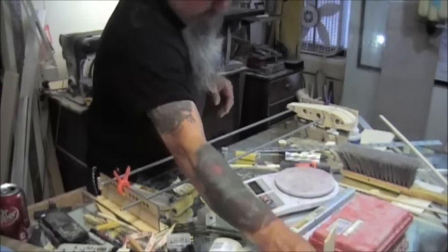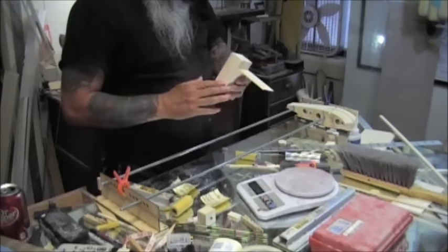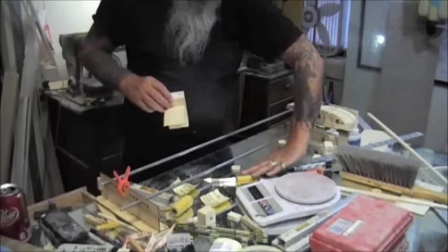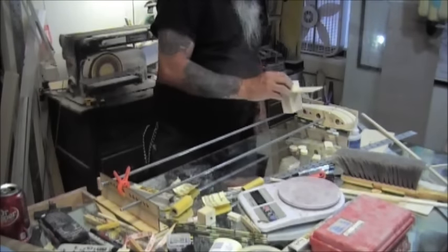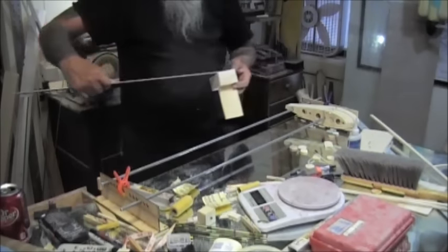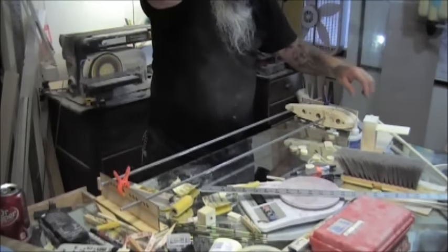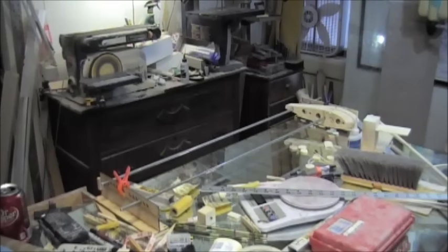Okay, what I did was, I made a jig, as I explained to you on the last, on the inboard, and I had glued an 1/8 inch piece on the side so that the rib sets were 2 1/8 apart. Well, I sanded that 1/8 inch piece off, and the outboard side is going to be 2 inches. So we're going to have 26 inboard, is that right? Or maybe I have to put a 16th back on it, because I don't want a whole lot of asymmetry.